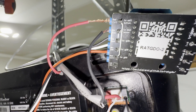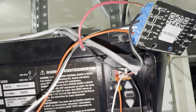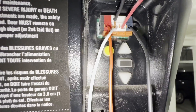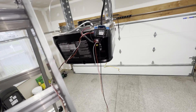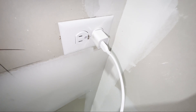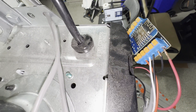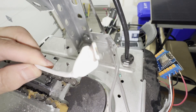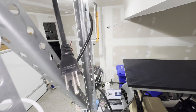So now that's pretty much it. You can see there are a total of five wires connected to the board: the two topmost ones are coming from either the wall switch or the obstruction sensor, and the other three cables go to the terminal ports on the garage door opener. Now, you don't want to forget to plug in a USB connector into a 5-volt USB power brick — that's what powers the board. There is also a terminal on the board itself to power it directly, but that's beyond the scope of the default setup, so I'm just going to use the micro-USB.